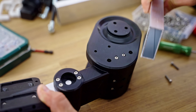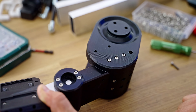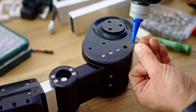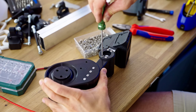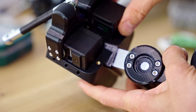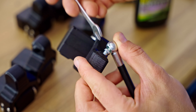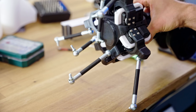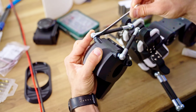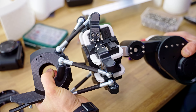Tapping and threading into a 2mm wall thickness piece of aluminum isn't the most reliable thing, so some of these screws are just in there for decoration. I'll keep these in with a generous amount of threadlock — we'll just keep that between us. This piece is going to be Carolin's frontmost joint arm. Threading these ball heads half a turn at a time was pretty tedious, but once they're in, they're in. This is one of those situations where a printed thread is totally fine — they'll only be tightened once, don't see a ton of external load, and the thread from the ball head goes in pretty far, so you get a ton of thread engagement.